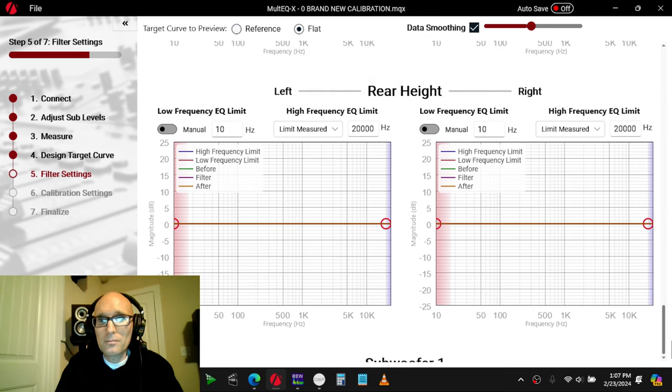Why I align in this way as well is because when you align in this way, you get to see things in a relative way versus what we already have. So as you can see, we're overshooting here. The purple here is the room curve version, right? One of the reasons it's overshooting is because we're applying this boost, and in miniDSP, it's allowed to continue. This just goes on forever. This boost continues up to 10 hertz.